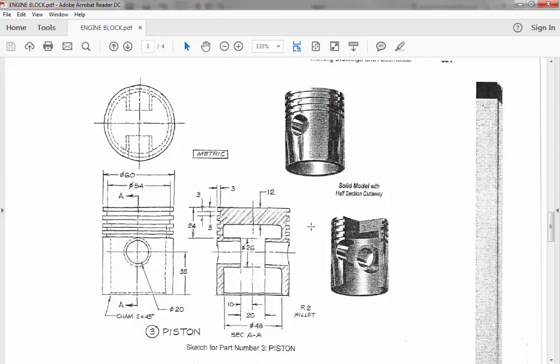So now on the other part here, some people were asking kind of about how to maybe handle this one. What I would do on this is I would do a revolve tool. You see the center line that runs down the middle here? I would create this shape of everything here, go straight down, come straight up, and skip this part. Just cut that out, just like it's not even there. Come straight up, come around, come back to this, and then I would revolve that shape right there, 360 degrees.